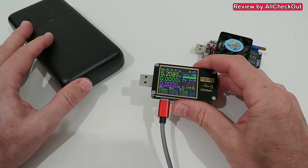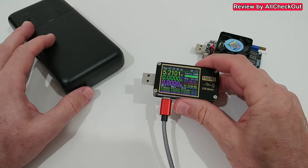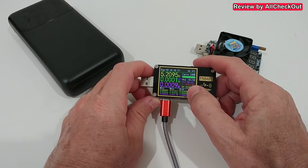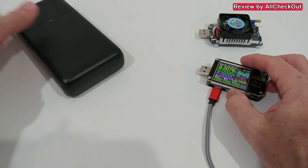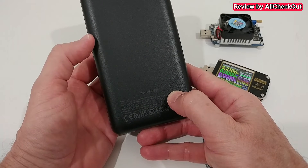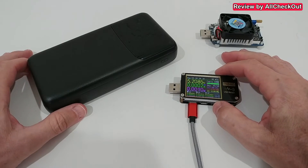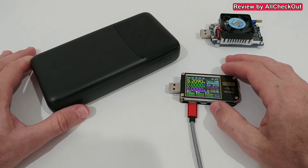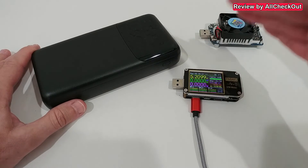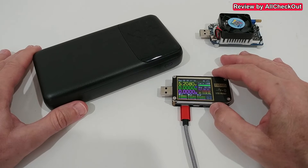At the maximum, a very good power bank would deliver around 32,500 mAh at 5V output from a so-called 50,000 mAh unit. I'd say you should expect at least a bare minimum of around 25,000 mAh at 5V. Everything below 50% of the rated capacity is definitely not enough — very close to a total scam. I rarely see numbers this low. I also noticed the label on the back shows no milliwatt-hours, which 90% of power banks these days do include. This power bank is super super disappointing regarding capacity, input power, and output power — very very close to a scam.